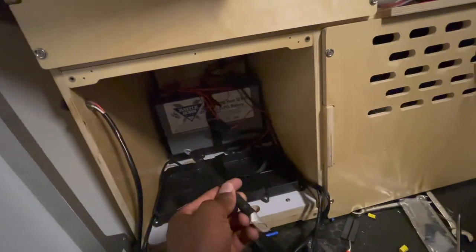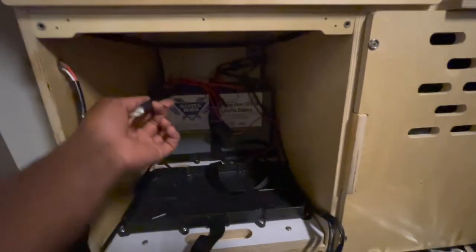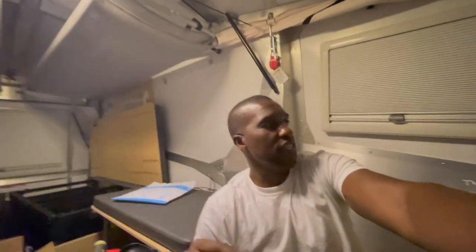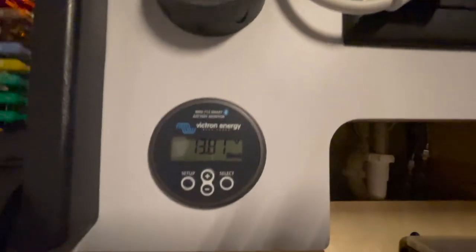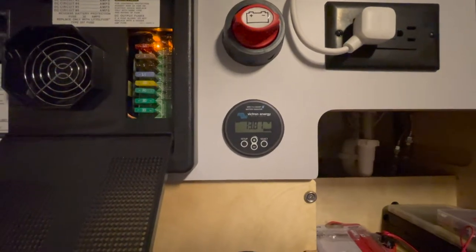When you're doing this, just because if you look in here, there's not enough room to run this from one battery to the other to do the parallel connection. And if you flip the battery the other way, the posts are on the opposite side - which is fine if you're trying to have a 24 volt system, but to do a 12 volt, these two need to be aligned: positive to positive and negative to negative. So I'm going to let this charge for a while - it's at 13.81 now. That should be able to charge up to 14.2 or 14.4 before too long. Then we'll switch the terminals to the other battery so that charges as well. When I put them in parallel, I want them both at the same voltage on maximum charge.